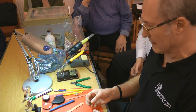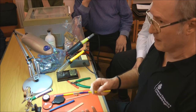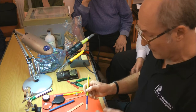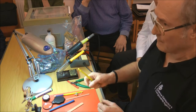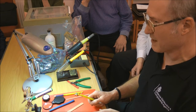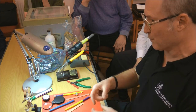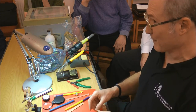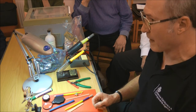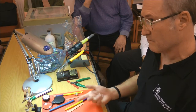It's very fine leaded. So using various brushes and isopropyl alcohol, cleaning it, and the leads are so fine that it would destroy them. So you're having to brush with the direction of the leads, solder it, desolder it, solder it, about 3 or 4 attempts before I got anything passable. And it was so poor in the end. There's a space on the board to do another example, so I got another chip, made sure it was clean, and then worked with that. So what I'm saying is lots of things look fine, they look clean, but they're not.